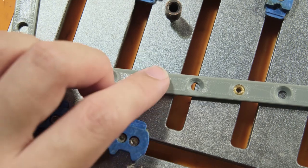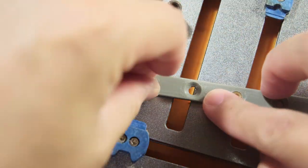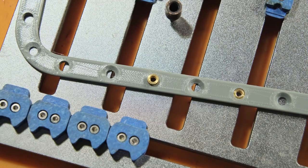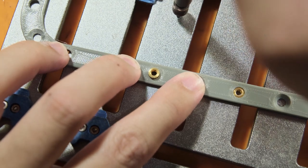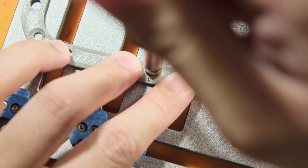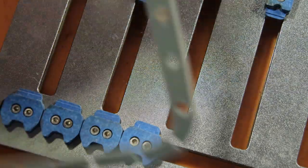The copper inserts will be installed onto the outer frame — the frame that we'll see on the underside of the vat. When installing them, I first laid them onto something flat and heat resistant, like my metal board holder, then placed the heat insert into the little gap that I designed into the 3D print. This is to prevent them from slipping around when pressing it down with my hot iron. Here you can see me using a wider nozzle in between the soldering iron and the copper insert, so that I can touch the ring around the insert and not go into it, as it can sometimes get stuck and end up shifting around and being difficult to pull out.